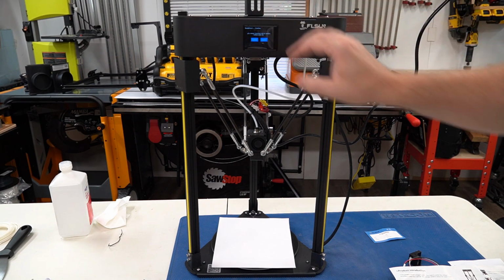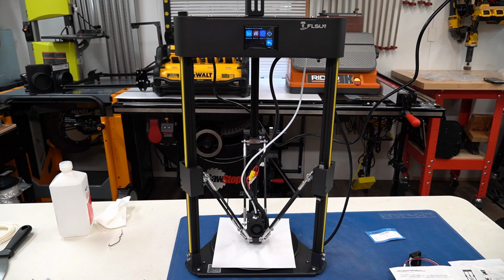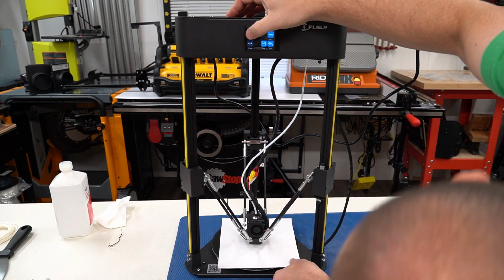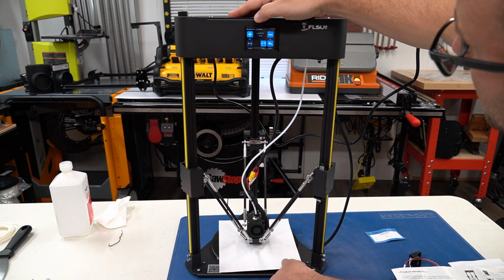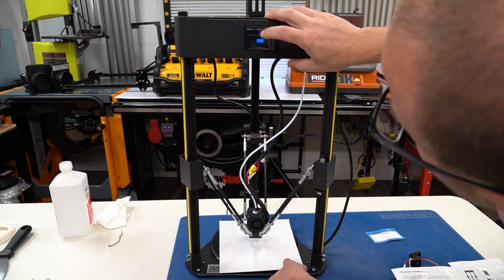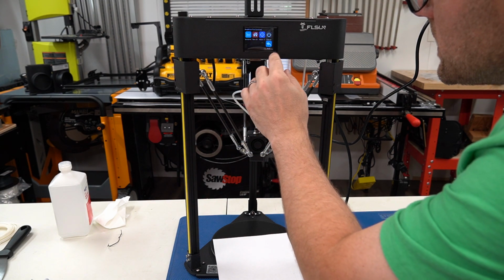We're going to click Move Z. Please remove the leveling switch. We've already done that. It levels itself and now it's going to come down. Now we're going to click on Adjust Z. And we're going to do the old normal bed leveling. And negative is down, positive is up. So that's that one. And we're going to hit Save. So we finished how far away it needs to be in the center. Accidentally hit it twice. So we're going to go back. So that's our Z offset.